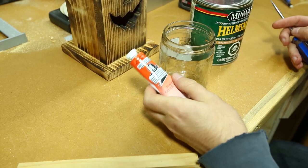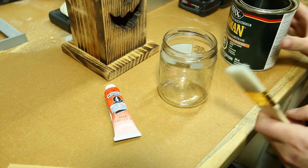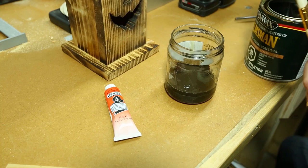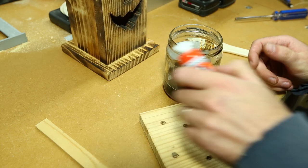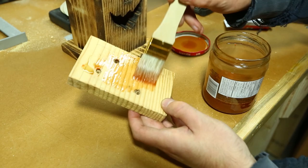One of the reasons I picked this project is because I wanted to try tinting my own finish. What you see here is a linseed oil based colouring that I picked up at a local craft store. I'm adding a little bit to some spar urethane and mixing it until I get the tint I want, testing it out on a little scrap piece of wood. If your lantern is not going to be out in the elements, you can just tint it with regular polyurethane or whatever else you may have, as long as it can be mixed with a linseed oil base.